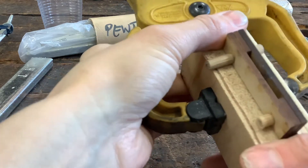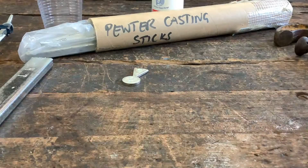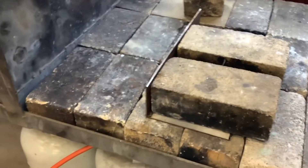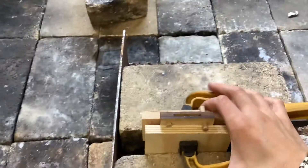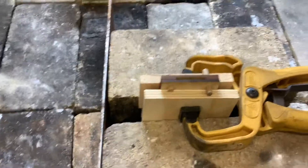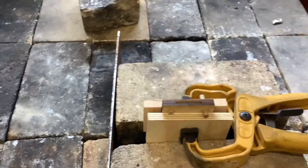We're going to set this up in our bricks. What we've got here is a bit of angled steel — that's just going to catch any pewter if the mold isn't sealed well, so it catches on that rather than falling through the holes in the bricks below. Those two bricks on top are going to hold the mold vertical. You can see how it slots in there, and then I can move the bricks forwards or backwards until it's sitting nicely and holding it in place.